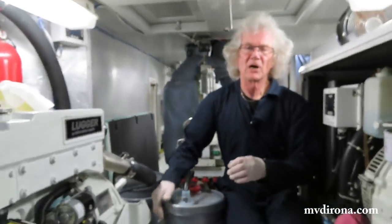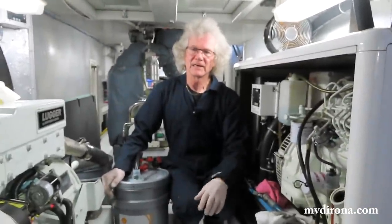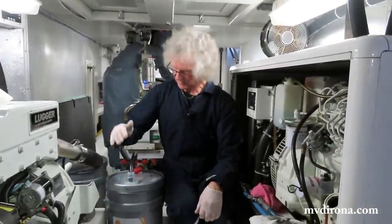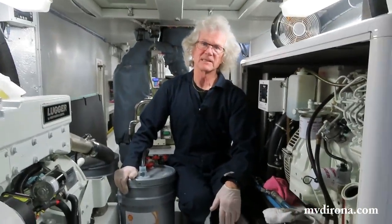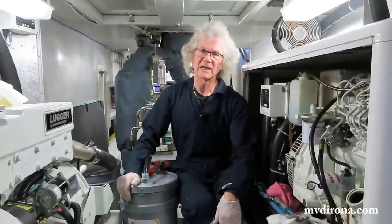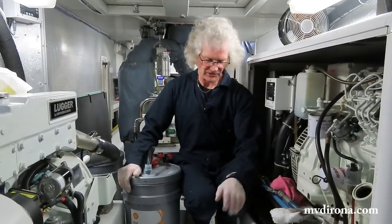And so a great oil is an ACEA E9. That's what this is. And an acceptable oil, and actually very good, is an E7. So that's just what I look for. I like Delo 400 and I like the Shell Rimula, but other oils work just fine too, not a problem.